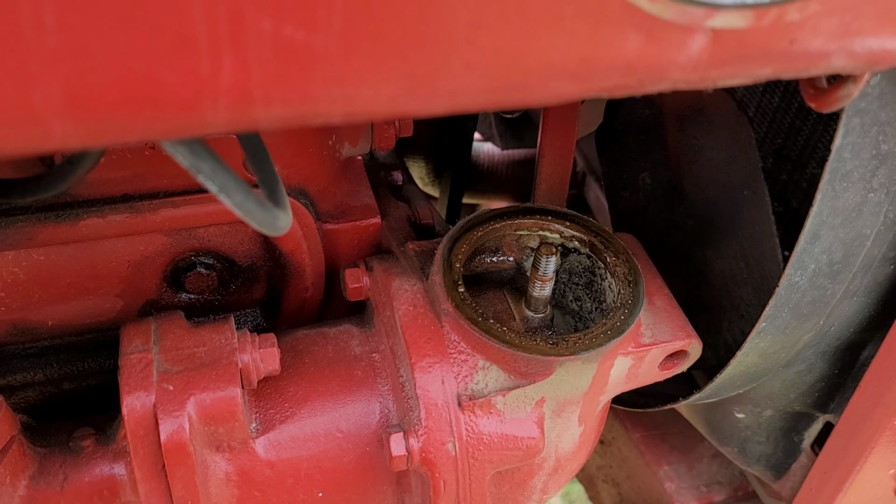One little incident that I did have, you can see this is bent out. A lot of guys would cut this, and I've even seen antique tractors come out of the factory with it cut like that. I have had people tell me they've got tractors, not necessarily Farmalls, that come cut for the upright distributor like that. But anyways, when I first got this tractor, it was skipping and missing, like a valve was sticking. Well, it wasn't that at all. It was skipping spark, and this was jumping off of this onto the hood. So I just bent that out.